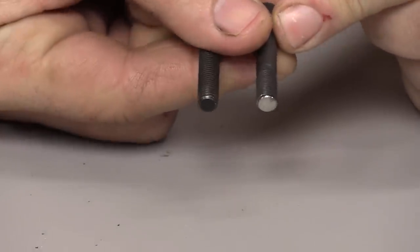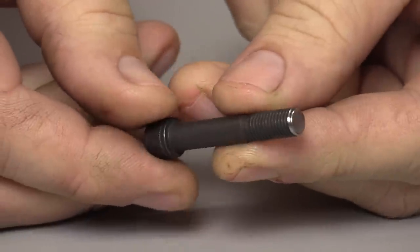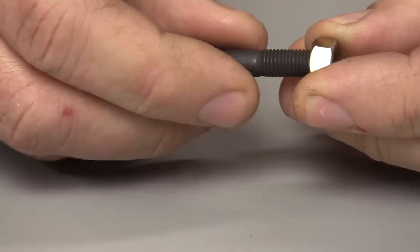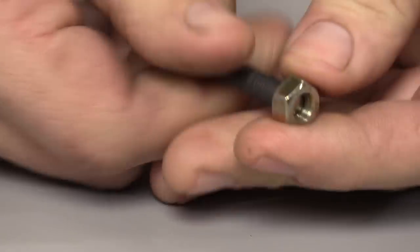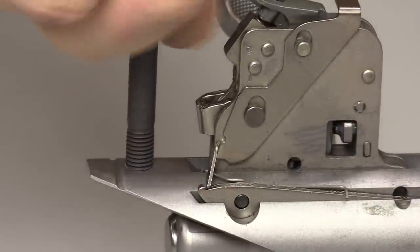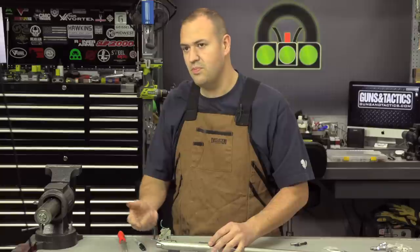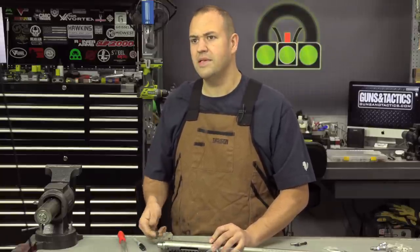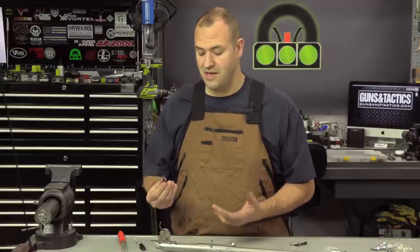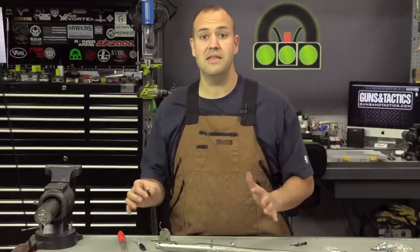Now we've wrapped up and we have our shortened screw. As you can see, I made it just a hair taller than my replacement screw — that was actually by design — but it has a nice smooth cut and that nice taper to make it match a factory-looking screw. It has no problem engaging with threads and it works perfectly. This is a success. The test is this is actually an action screw, so I'm going to test it in the final application before I put everything together. I'm just going to line up the screw — and as you can see, the screw fits the action perfectly. This particular one is a socket head cap screw, quarter-28, to match a Remington 700. That is just how easy it is to shorten a screw. I just prefer the belt sander — it makes short work of it. And if you really wanted to, you could take some cold blue to the surface of the screw and it would make it look basically like a complete factory screw.